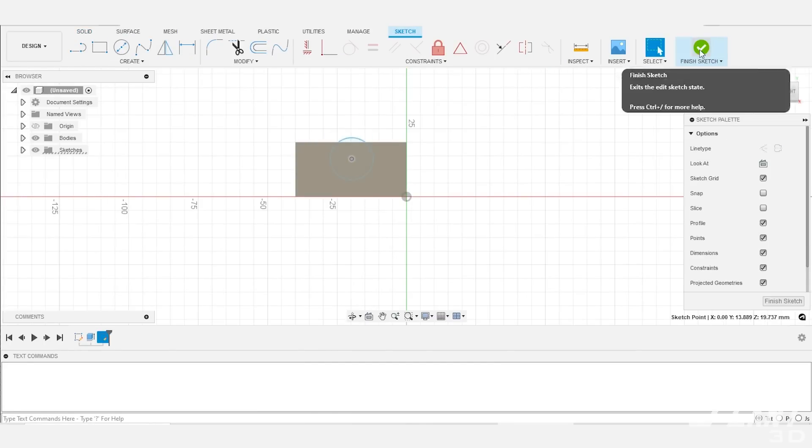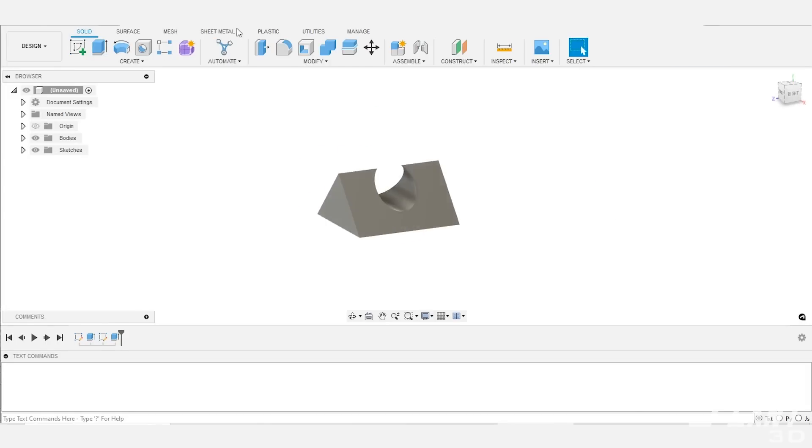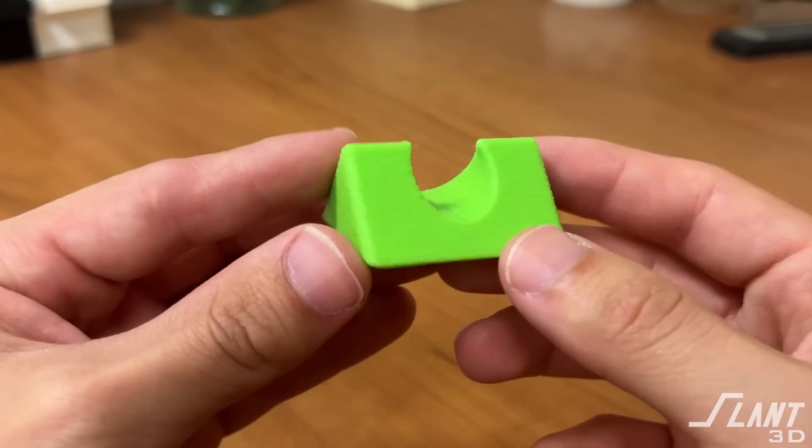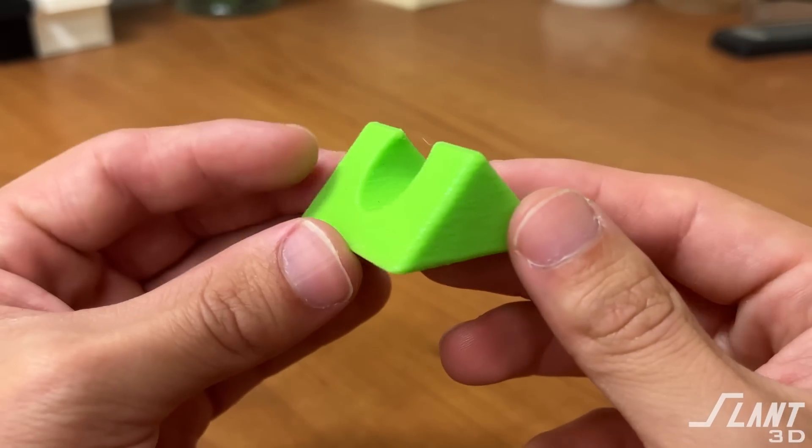This design is a triangle with a slot cut inside of it. It's omnidirectional — you can hang it upside down or forward, and it can hold whatever you want. You can also change the size and shape of the interior circle to get a better hook. Printed this way, it's very strong, reliable, and quite mass-producible. The back surface is the bed surface of the printer, giving you a consistent surface that nobody sees, so it doesn't affect the aesthetic. Just make sure to round all the corners and avoid overhangs that would require support — these can go quite a bit steeper.